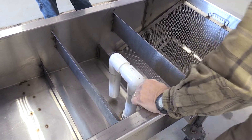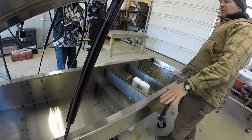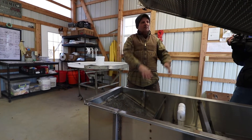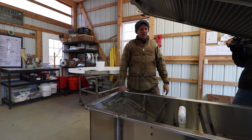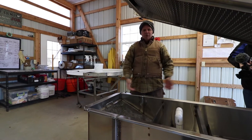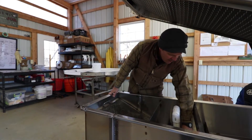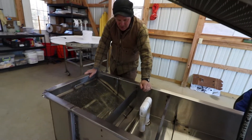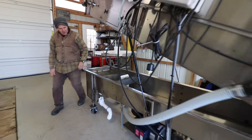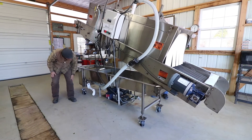Since this contains a set amount of water, you fill it up initially, but since I'm also running the high pressure water and the rinse I'm adding approximately 20 or more gallons per minute. It all comes down this basin, so there's a lot of water moving through it, and at some point it begins to overflow and drain out because I'm putting a lot of fresh water back into the system. Periodically I might drain it a little bit while operating to pull off some of the soil.